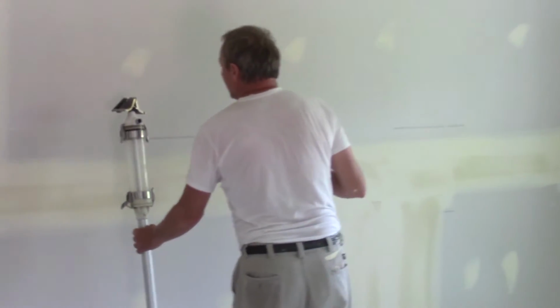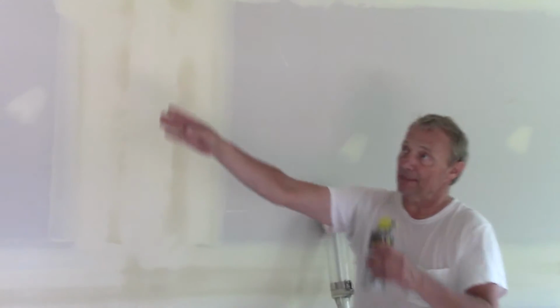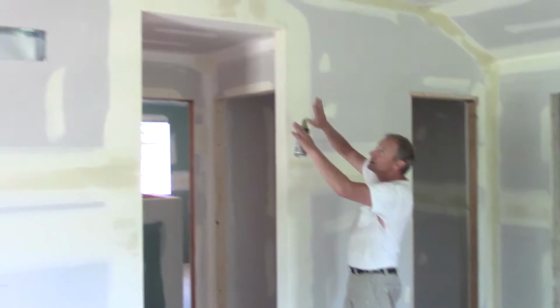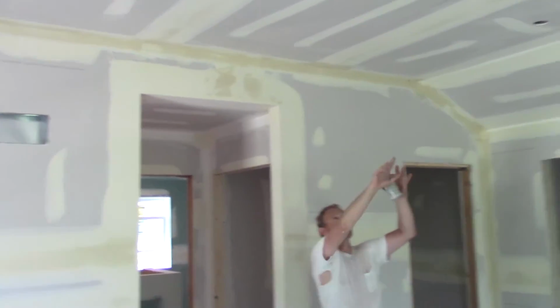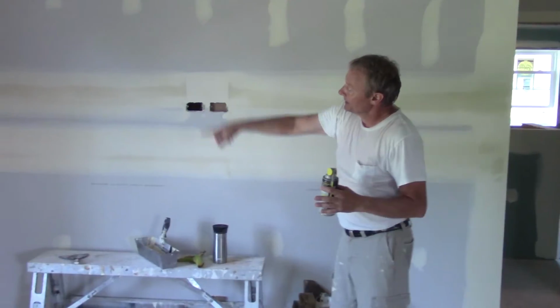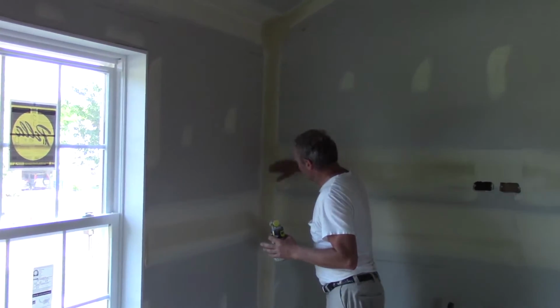If you noticed, I dusted everything down. I boxed all of the box. Then I put in my angles. I get all my angles in. And next, I will run the corner bead. And when I'm spotting the screws and crossing off the seams and all the butt joints, that's when I will touch up my angles and I'll skim the edge on the angles that's here, right here.